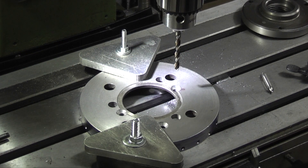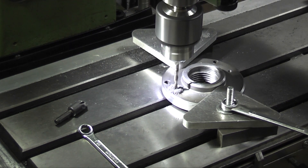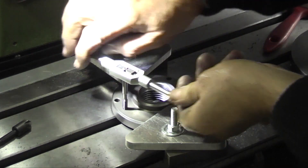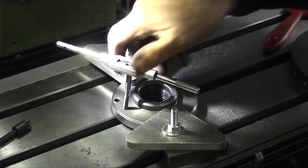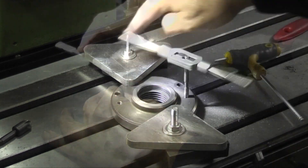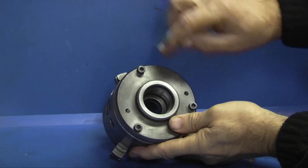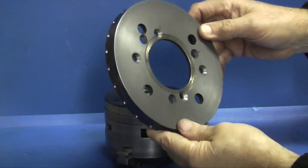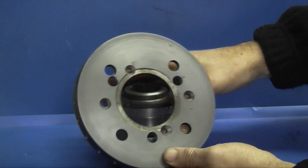That should be finished on the indexing ring. All I need to do now is swap that for the back plate. Just tap the hole M6. On the back of the chuck all I've done is drilled and tapped these two holes, so it doesn't affect the chuck in any way. In the indexing ring I drilled three holes on the pitch circle and two holes across the middle here with the countersink in, and this will only fit on one way.